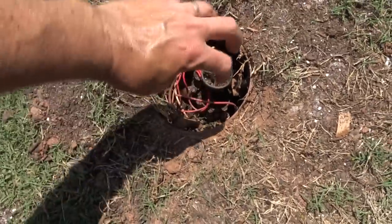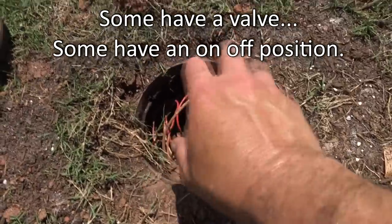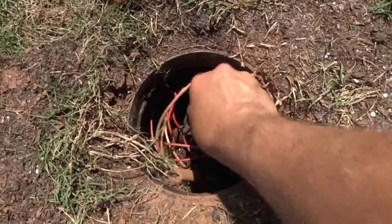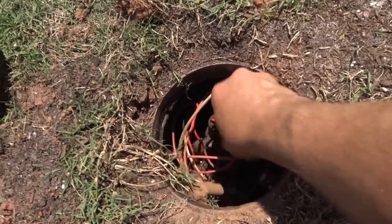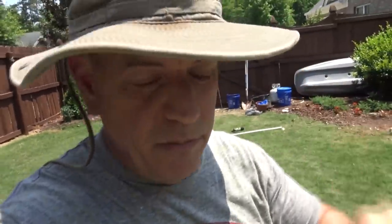On this one, it works just like a hose spigot. You see this round thing — if you want to shut off those stations, you go ahead and turn it down, just like a regular hose. Do it counterclockwise and it opens it up. We couldn't even really identify these old valves — we think they're old Hunter ones. We put in a new Rainbird one over here too. But at some point there's some kind of manual on/off switch on those things. So if you have a big blowout, you can figure out which station it's on and shut it off per station. That's important to know.